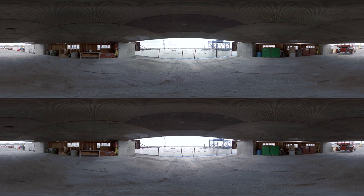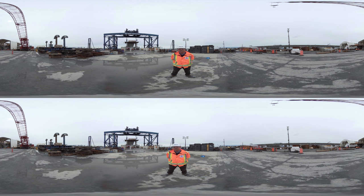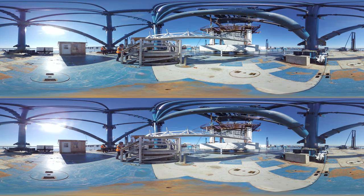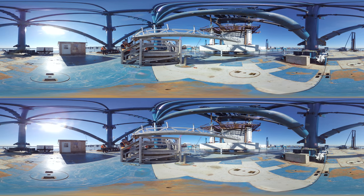We showed interest to Sarens in providing equipment that would allow us to set the footing in very hostile water conditions where the velocity is very high and the water is very shallow. We required equipment that would draft minimum water and be capable of sailing with a 1,000 tonne footing independent of any supporting tugs.